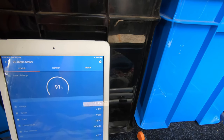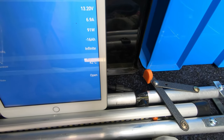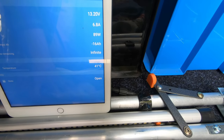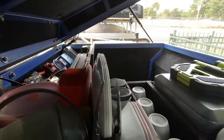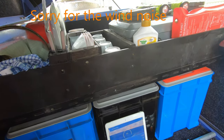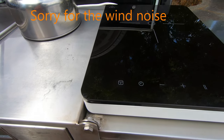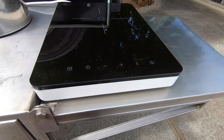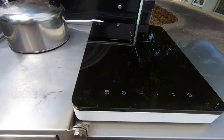The BMV shunt temperature ended on 42 degrees Celsius. We were pulling out that many amps, and it's going back down to normal temperature again. That gives me a good indicator of my wire temperature too, by the way. I think that's successful — I think I can put the trailer back together again and put the fridge and freezers and everything in. Hope you enjoyed that little video. As long as you're getting sunshine with two 100 amp hour lithium batteries, I think you could live LPG free while camping. Keep safe everyone, bye for now.